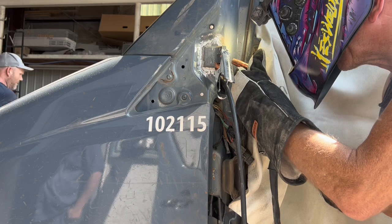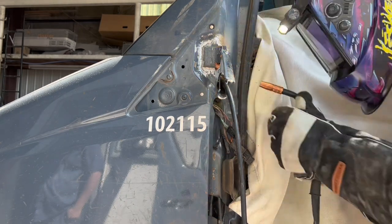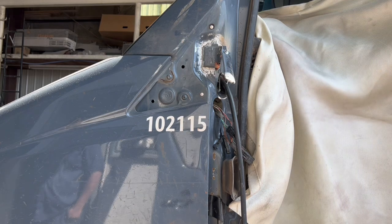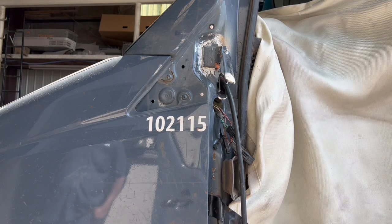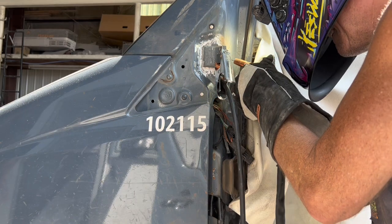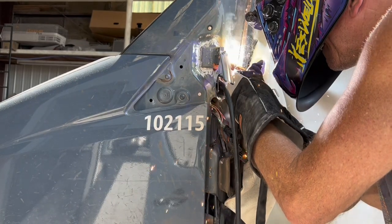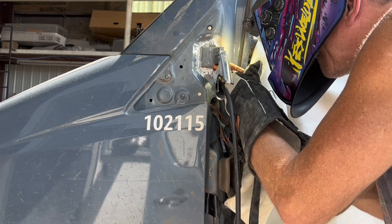Get the thicker metal hot, carry it over to the sheet metal, then stop — because the sheet metal will blow out if you try to keep that bead going. I form a puddle in the thicker metal that goes deep into that thick metal, then move over to the sheet metal and let off the trigger when it fuses with the sheet metal. Yes, the welder is doing a fabulous job — I'm having no trouble whatsoever.